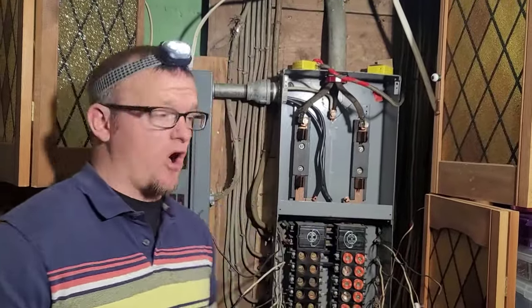So we're going to take our time, work all of these out, and be very careful not to cut it on the side of the panel. I'm going to shoot a quick shot showing you the Wadsworth inside and the odd breakers. First, I'm going to mark off any wires with red or black tape that were not hooked up before I got here. Then mark all my white 220s black, check for any black neutrals on the neutral bar, then dismantle the panel, remove all the Romex lock rings or connectors, and completely remove the panel.